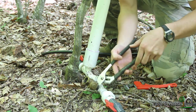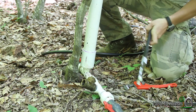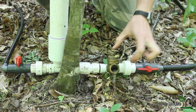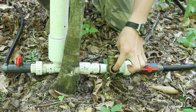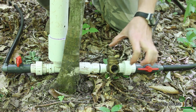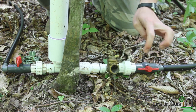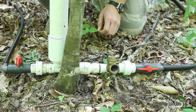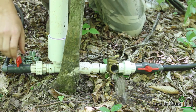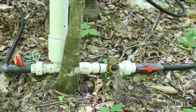We want the flap to close from the top. All right, let's try it out and see if we can get this thing going. I'm going to push my stopwatch and slowly open the delivery pipe. I think I need another rock on this drive pipe — it's bouncing around.